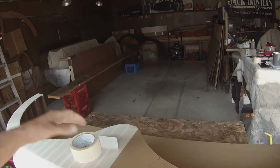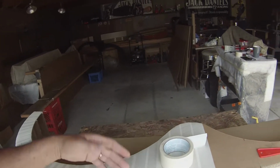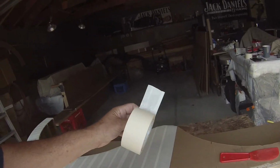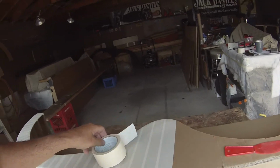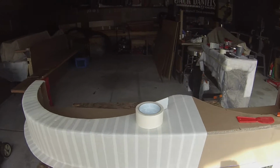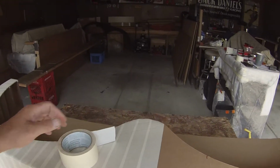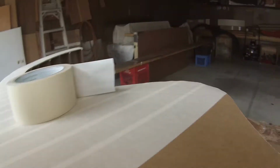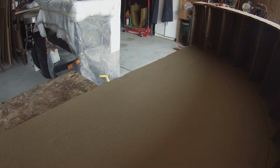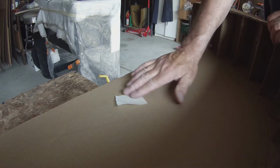All adhesives, tapes, foam, sticky back foam, anything that's sticky back. Not glue so much, obviously, out of a spray can or out of a jar or whatever, but any of this type of stuff, this adhesive is actually pressure sensitive or pressure activated. So what I'm doing is, you can see a big difference between just putting this stuff on here. I'll peel a piece off real quick. Just sit you here, shine you down there. I'm going to try to get you so you can see it, but here's a piece here, right? And I'm just going to rub it on with my fingers.